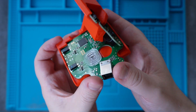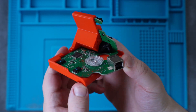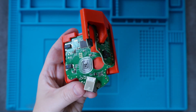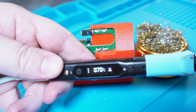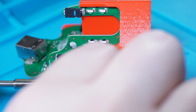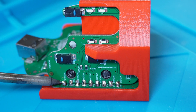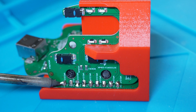It is absolutely critical at this point that the alignment with the anchor and jig is correct and that it's fitted all the way in — if this is wrong you're going to have a lot of problems later on, so be sure to double-check it. Also check that the solder pads are aligned. Now heat up your soldering iron very hot — I used 420 degrees — and then simply solder each pair of large copper pads together. I'd recommend making contact with both copper pads using your iron so they're both adequately heated as you apply the solder.